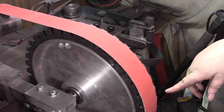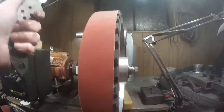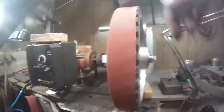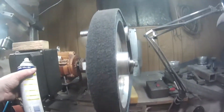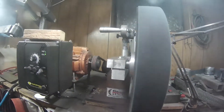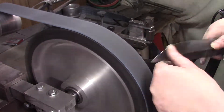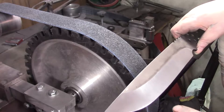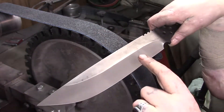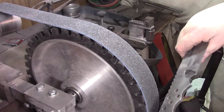I'm going to put the Scotchbrite on. Thanks to Steve Miller Knives — the Scotchbrite and some WD-40 really helps it out. Just turn it on and spray down some WD-40. One thing I noticed last time: I pushed it too far back and it really blurred the lines. But if you keep it nice and crisp, it stays pretty good. One more side and we're done.